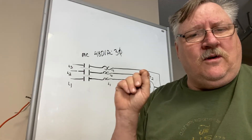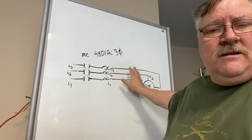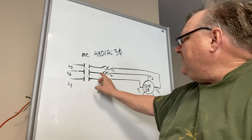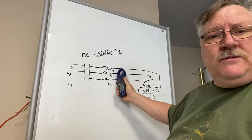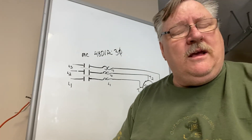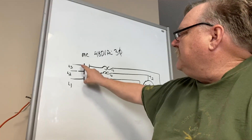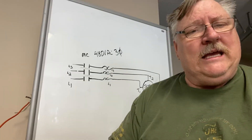So what do we do? First thing we check is overloads and any other overcurrent protection. Next thing, with the circuit de-energized, check for resistance to ground — we should have nothing. Then use our clamp meter: turn the thing back on and check each one of our phases for current draw — they should be the same, unless you've got an electric brake on that motor. Then you can check your voltage drop across your contactors to see if there's bad contacts — because low voltage there is going to put higher current on that leg.